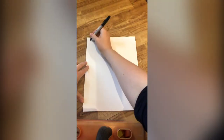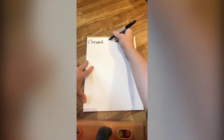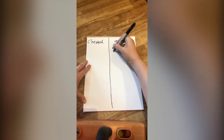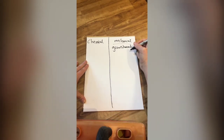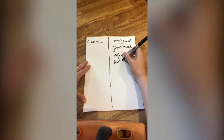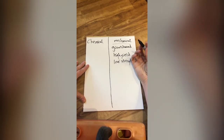There are two kinds of pulping: chemical and mechanical. In pulping, what you're trying to do is expose the cellulose fiber so that there are bonding sites for the paper web to stay together. In mechanical pulping — ground wood pulping — the process is exactly how it sounds: the wood is ground into itty bitty pieces so that the fibers are exposed and bonding can happen. Nothing is removed, so the lignins remain, the waxes remain. Because of this, it's a very high-yield pulping process, but a very low-strength process and a low-quality paper because the lignins are still there.